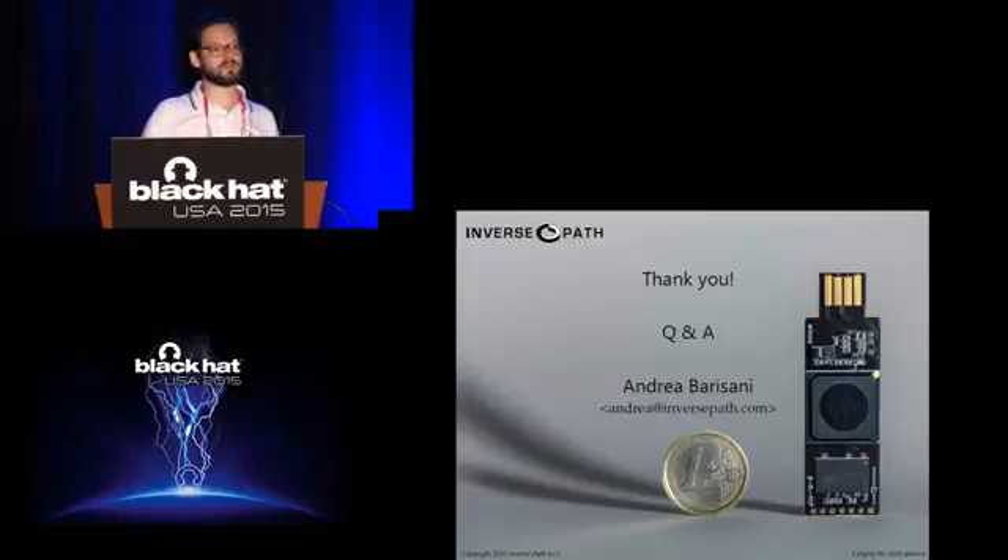Regarding secure boot: U-boot is plain text but can be signed with encryption keys that you fuse on the SOC. You can fuse up to four signature keys, and then that single device will only boot things that are signed. If you lose your private keys, you have a brick. You can also fuse random signing keys to make the hardware device unusable if you want — a way of nuking the hardware itself. We ship it without keys. We plan in the future to offer an option where when you order it, you provide your public key hash and we fuse it so that in transit the device can only boot your code — though we need to be careful because if customers lose the key, there are support implications.